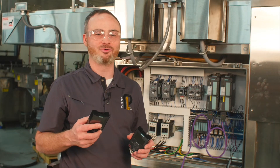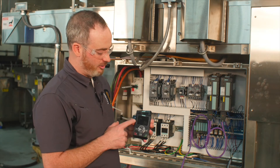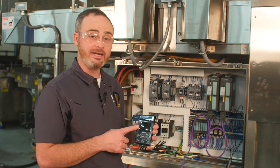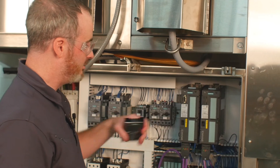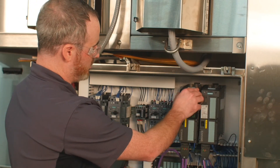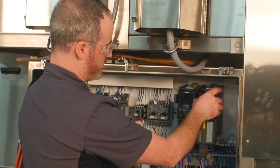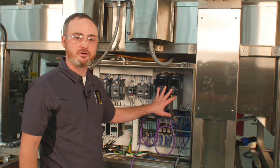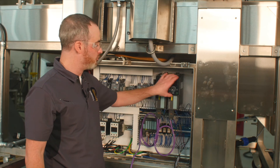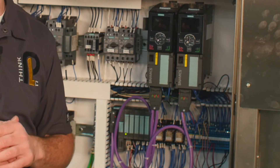To put the new displays on the G120s, connect them to the front of the already-installed control units. Supply power and you'll get fault feedback information, speed, and diagnostics. To plug in: move back the tab, find the DB9 connector, drop the bottom end first, and snap. We're providing two displays for diagnostics — before, you just had one movable display. Now just open the door to see faults or messages directly on the drive.